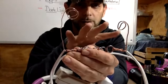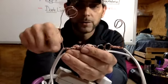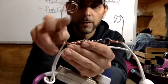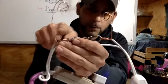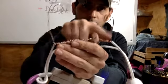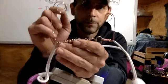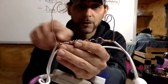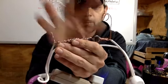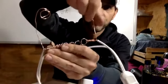You put 4 capacitors on here. You start at the source end, okay, which is this end. All right. You start at the source end, and it's this side. Then it goes to the other side, moves up, goes to this side, and you switch the polarities back and forth so that they're in series. Okay. So you have an in series set of capacitors that are in a parallel connection. That's what this is. All right.